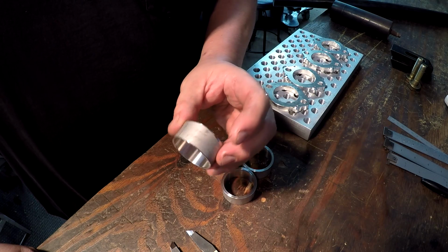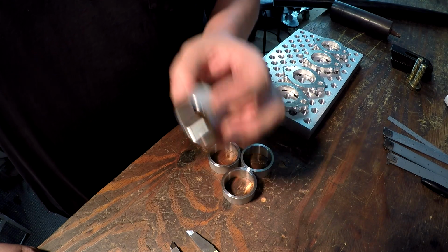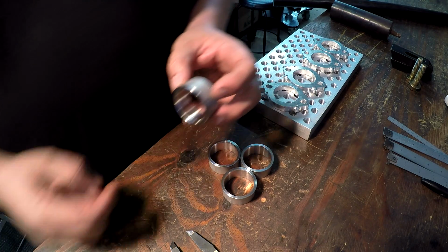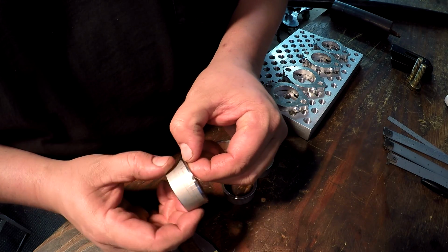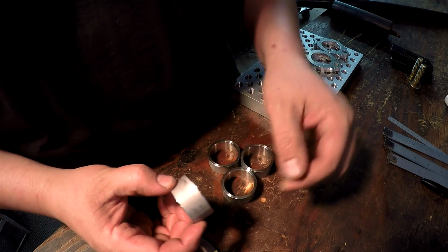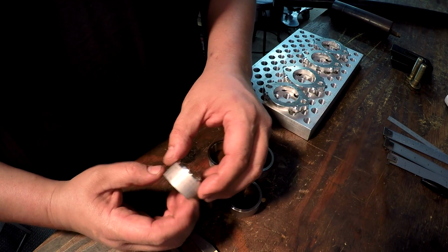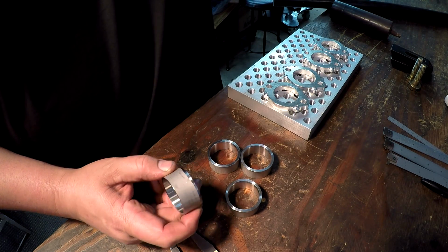These are going to be a little tricky to hold. One way that you could do it, if you have what they call an emergency collet, you could actually bore that where this could fit in there. This has been machined, so you've got a true diameter all the way around that, even though it's a little bit thinner right there, and all of them are pretty consistent. You could do that. I don't have an emergency style collet to hold that.